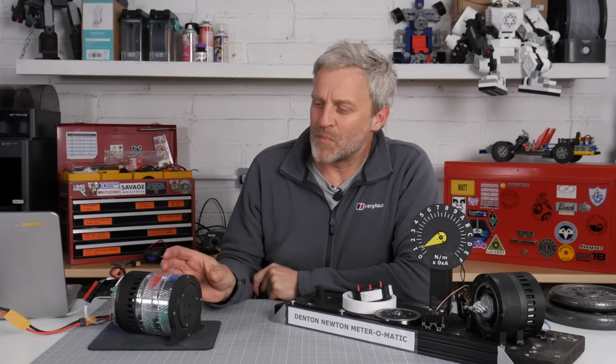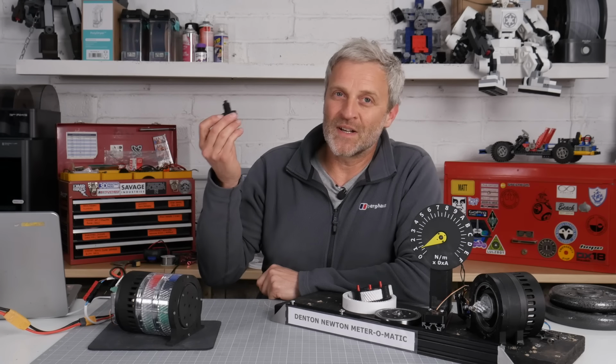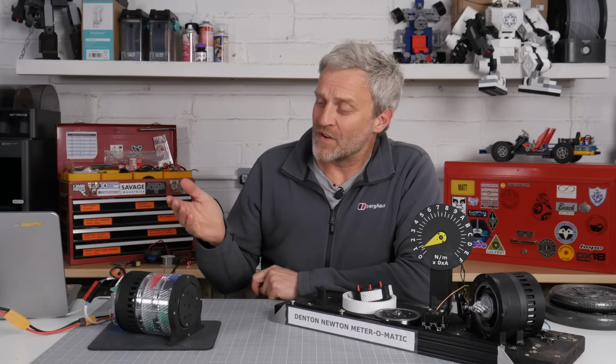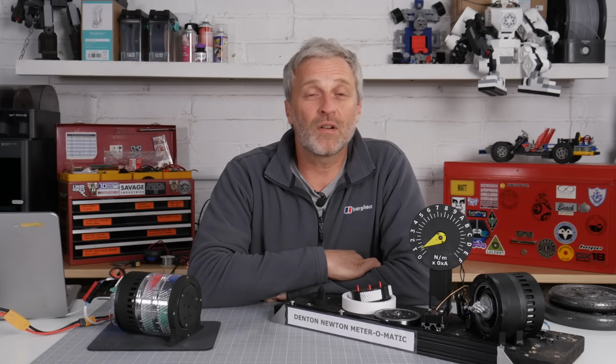But just because I can do it doesn't mean to say that I should do it. I think that's where the Jurassic Park scientists went wrong. So I can produce quite a low-cost gearbox because I can print most of it on an FDM printer, except maybe one sun gear that might need professionally printing. However, the electronics and motor is going to be very expensive, and on a hexapod you need 18 of everything because there's 3 degrees of freedom on every leg. I always said that I'd never build another hexapod after I finished the Mantis because it pretty much broke me mind, body and soul. This one might be a lot easier, but it's still going to be very expensive, so the jury's still out on that.